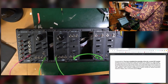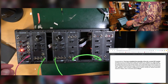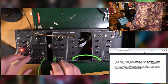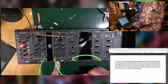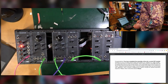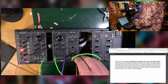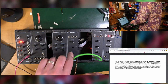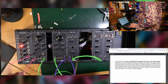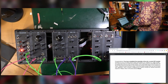Right, so let's have a look. Where are we? Got this on here. Let's turn the thing on again, and let's see whether we can get some action. So I want to take my output ultimately from my VCA. So I've got my pulse going in. I've only got the one input. Okay, so I'm just going to take this from the other side. Like that. This out's going to go into there. Now I'm going to want triggering of things. So this is CV out. That's going to go into there. I want the gate out, that one to be triggering my envelope.